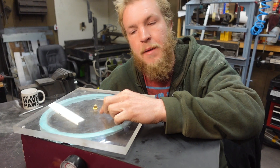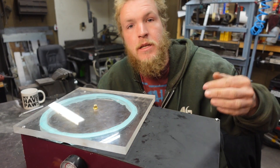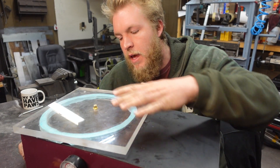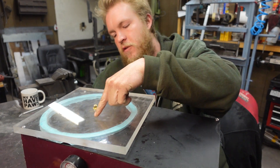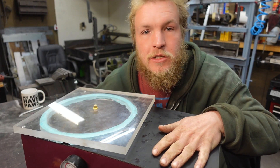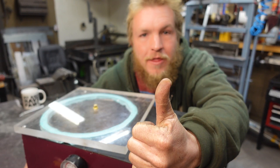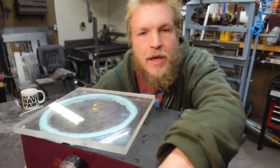The hole on the top here is tapped quarter inch NPT. So one, I can hook a hose up to this and pull a vacuum into something else if that's what I need. Two, I can remove the plug, make a high temperature gasket here and put my mold on top to do some vacuum casting. So I think this thing's going to serve me pretty well. If you like what you saw here, leave a thumbs up, maybe subscribe, and thank you for watching.